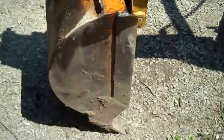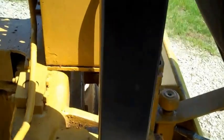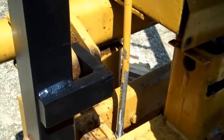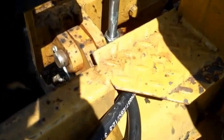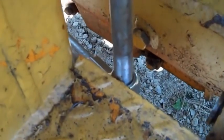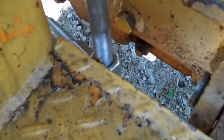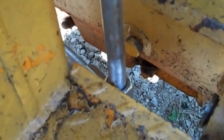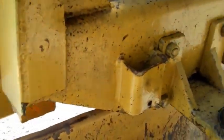I park it like this. Looks like there's a little leak here. That hydraulic fitting right there, that tube is round. It's got a very tight radius on it, and what's happening is it's leaking right there. I don't know if you can see that. It's either in the front sunlight or the shadow, but when it's under pressure, it pees out right there. And I think what the deal is, that one too, is that tubing was out around. I don't know if it was bent up or chowdered up or whatever. And I don't think that fitting fits on there, what do you want to call it, correctly, and it seeps out, so it pisses out oil, which is kind of a bummer because I hate it when my equipment leaks oil. But you can see it.